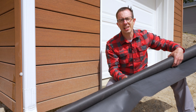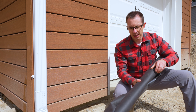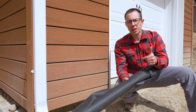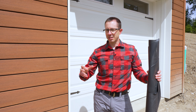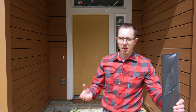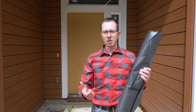Here's the Cypress AZEC cladding — I'll show you a little bit about what goes on behind that. We're in Washington state and the sun's actually come out, so we do have to deal with the sun from time to time. What we used is this Benjamin Obdyke WRB. This is the outside of it — it feels like a very pretty heavy, coarse woven material. We've installed a lot of types of house wrap, and this is by far the best quality feel of one that we've installed. This is rated for ultraviolet radiation exposure. House wrap in general isn't designed to be exposed to UV radiation, so it'll degrade and become brittle and flake away. That's part of the reason we install cladding on houses — to maintain the material integrity of the house wrap. In this case, this is designed for exposure to that UV radiation.